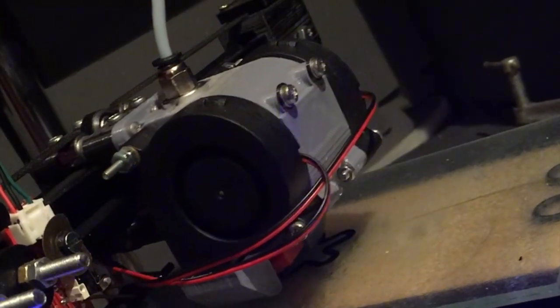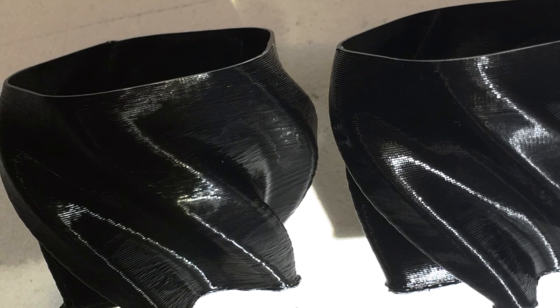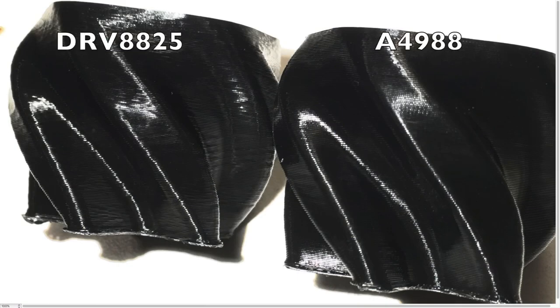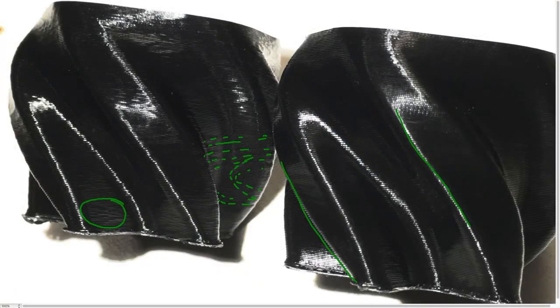So onto the test — we print and we print and then we print some more. Here's the results. On the left you're going to see the DRV8825 without any diodes on it, and on the right is the Allegro. You'll notice the nice smooth, even layers on the Allegro. But on the DRV8825, you can see these tree ring patterns — or salmon skin, or moire, or whatever you want to call it — interference patterns that manifest on the sides and on the gradually curved flat surfaces. It's also easy to see on the edges where the reflections highlight it, whereas it's nice and smooth on the Allegro.